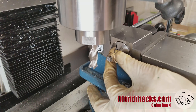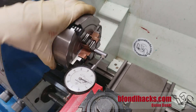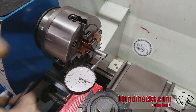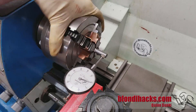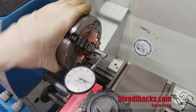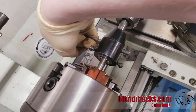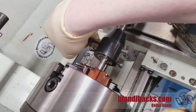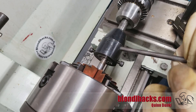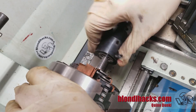I'll test fit and that's perfect — that's the part from inside the lock. Now we're going to indicate the part back on the lathe using the four-jaw chuck with copper soft jaws on there to protect it, and we're going to cut the new threads. By cutting these threads on the lathe we make sure that they are very, very straight. New threads look good.